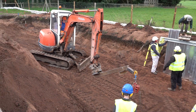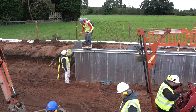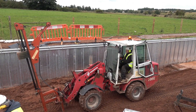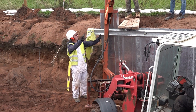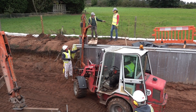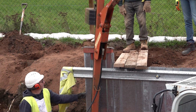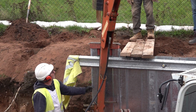This is our little fly jib that we constructed onto the end of the jib. We took a bucket attachment and made a tiny fly jib for the excavator, so you can pick the pile and pitch it from high up. If you look at the geometry of that machine, trying to lift his bucket up to that level with the pile is just too much. I call it a fly jib because you put fly jibs on the end of cranes and do the same thing. You can see — puts a pile in, drives the pile in very, very quickly. They drove that whole row of piles from here right to the end of the day.